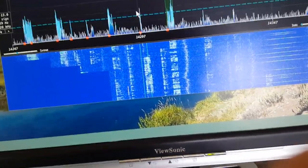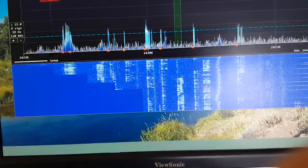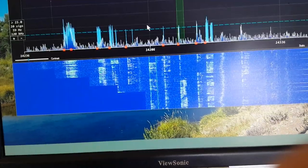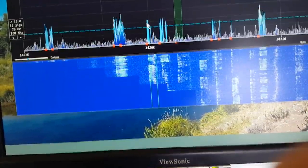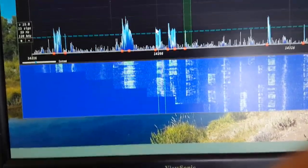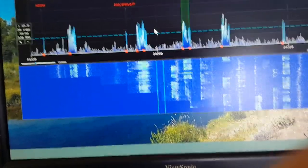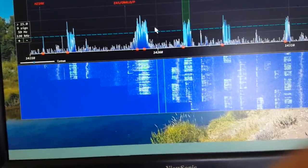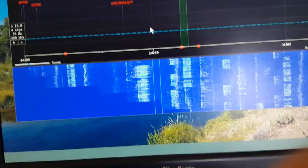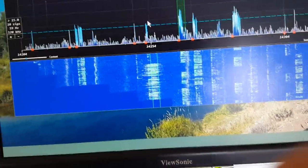This is with decay set to fast and it does not have the rounding to the nearest half kilohertz. We're at 60 Hertz per bin and that gives us pretty accurate finding of signals. So it works pretty well.